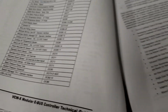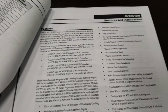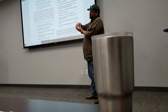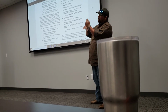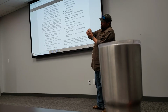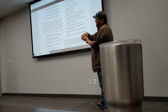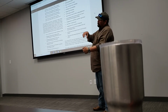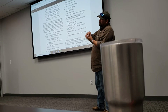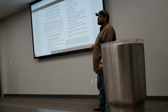Differences between handheld service tools and USB link laptop version of it. You've got the scroll on bottom, you've got a scroll on top, and it's compressing gas. Just in simple terms, you've got a solenoid with a port that comes off the discharge, and this I'm just trying to make it simple so y'all understand. It pushes pressure down on the top scroll, keeps it engaged. It's compressing gas, it's moving gas forward, it's loaded. If it needs to reduce capacity of the compressor, there's a solenoid valve that goes either external unloader or an internal unloader. It comes from that top section, it goes back to suction, and it allows that top to shift up. That top scroll shifts up, gas starts bypassing internally.